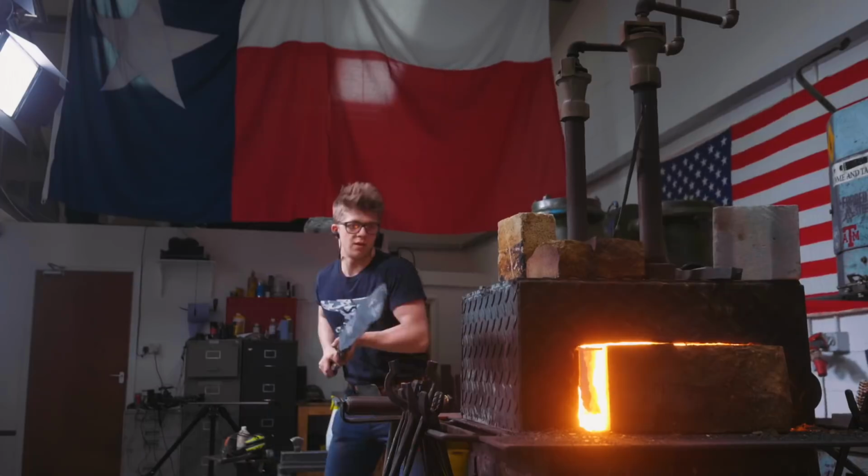I'm going to try it, just in case this works. I can bring down the width of the blade and actually get enough length for us to draw the tang out in front of where that crack is. This might work, this might not. Of course, worst comes to worst, we just start again. I fully understand I might well have to do this, but I want to give this a try too. See how much extra length we can stretch out of it by bringing that width down a little bit closer to what the Claymore's width should be.